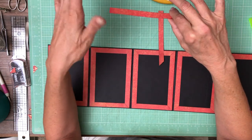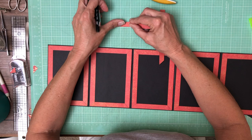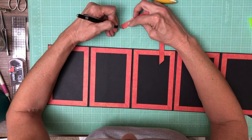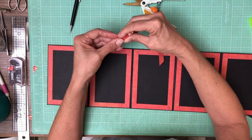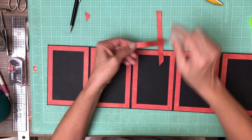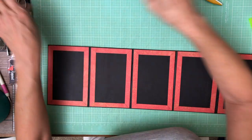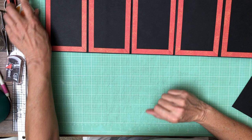So each strip is a half inch wide. What you're going to do is lay this down and mark one half inch in, and then go from that mark to that corner. I actually doubled up so I would only have to cut each strip once, and you're going to create that miter — and that's how I do it. I meant to show that to you in the first place but I got so busy and wasn't paying attention that I wasn't recording. So I went ahead and did that for all six panels.